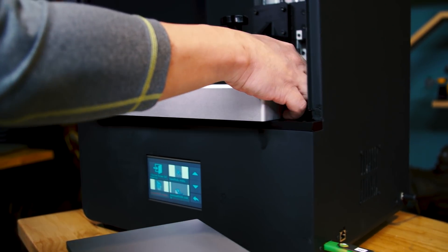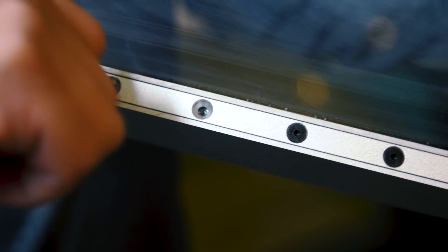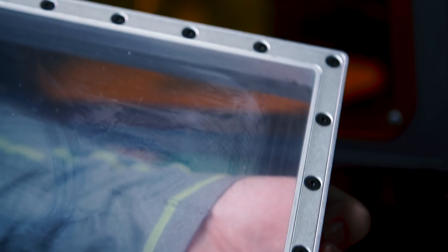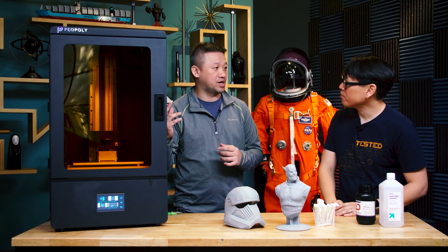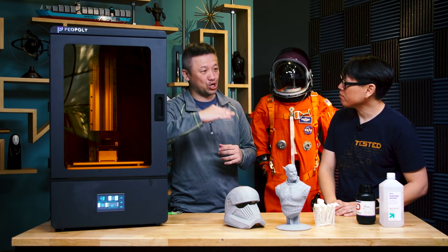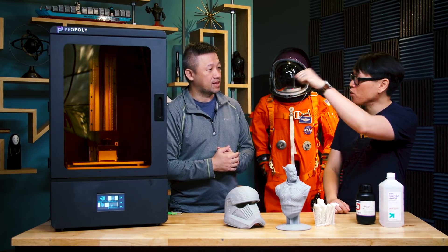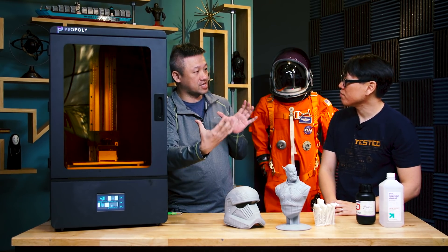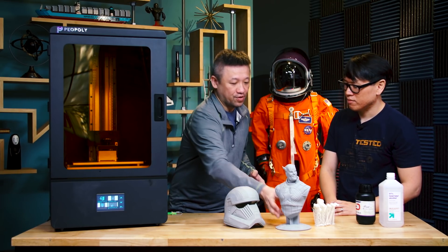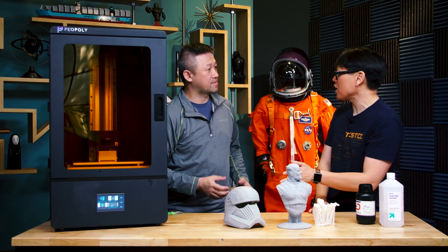The way we set it up is you lay it on the prefixed holes, tighten the screws and they automatically tension the films to a predetermined force — you don't want to over-tighten or over-loosen. Because we were able to reduce a lot of the peel forces, we could use a full solid plate instead of a perforated plate, which means you get a very clean bottom. You don't get little spots you have to sand off. All of these prints were right off the printer without any finishing.